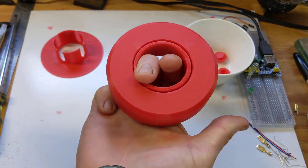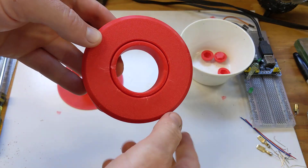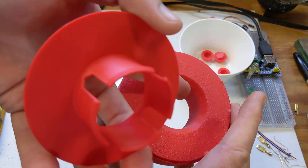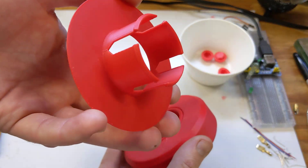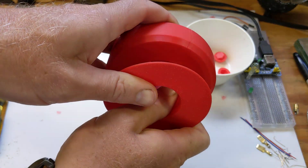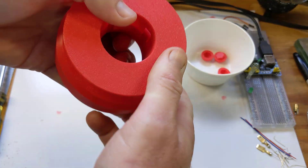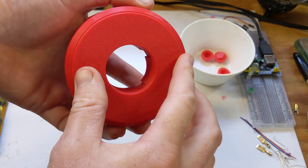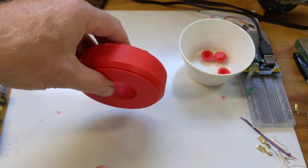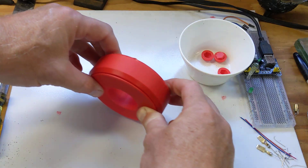Even with the damage it's still functional, just not as smooth as before. I didn't want this area to be open to outside elements, so I created a snap flange — basically a retainer with a chamfer and little flexing tabs. It's much easier to see how it works in demonstration. Like that — so that protects from dust, debris, rocks, and stuff getting in there. So this is a snap wheel bearing, 100% PLA.